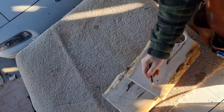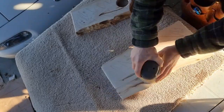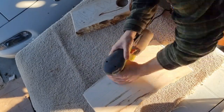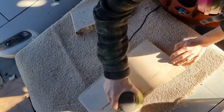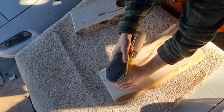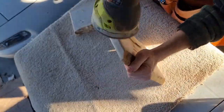I won't make you sit around and watch the whole sanding process but I'm starting at about 80 grit here, taking both boards down. Not hitting the live edge at this point because I don't want to take off too much material. Being sure to hit the round-overs and any extra material that the router sometimes chews up.